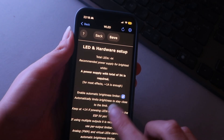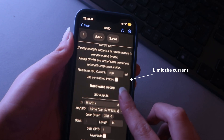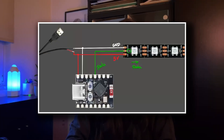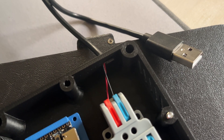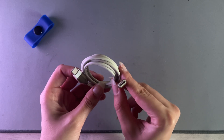In the configuration, select the GPIO pin that you will connect the beginning of the LED strip to. Very important: if you're not using an external power supply and are powering the LEDs directly from the ESP32, you should limit the current to under 500mA — these tiny boards cannot handle a lot of current. Since I wanted to see how bright this assembly could be, I used an external power supply. I connected the 5V input directly to the VIN pin on the ESP32 and to the LED strip, stripping an old USB cable to do that. In the future, I'm thinking of getting some USB-C sockets and using a regular USB-C cable to power it, which will be more convenient when I want to move it.